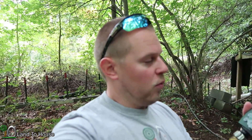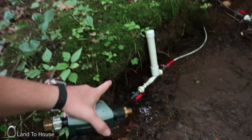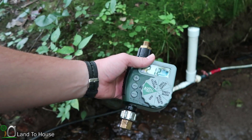I wasn't expecting the timer to work up there, but for a different reason than I thought. My concern was: what if a leak develops somewhere up top and all the water drains out of the drive pipe, and then the timer clicks on? A surge of water will hit that check valve and close it, and it won't reopen again. So now I'd like to put this down below, where it has all the head pressure behind it for a higher flow rate.